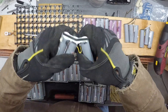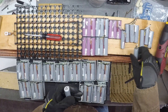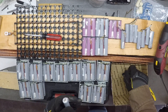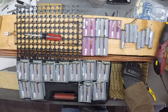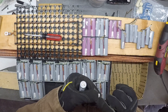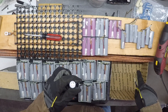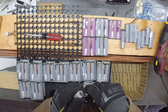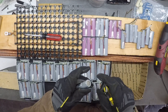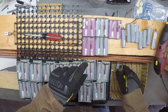Same way here — pull it off. You can just separate it down to where it's just a few cells. Pull that one down there. When I get them down to this point, there's a few little separators to get rid of. Then I'll take my side cuts and go through and clean them up — get all the tape and stickers off. But just for this video I'm going to peel off the spot-welded nickel plating metal. So what you've got left is some little sharp barbs, which you've got to be careful with — they'll get you.